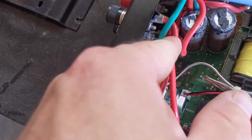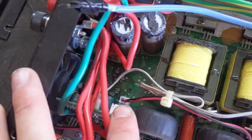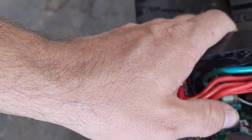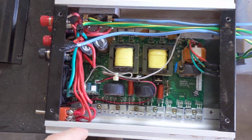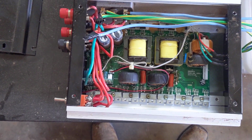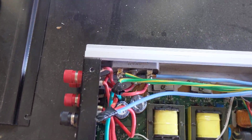And then it's hard for me. I think that this over here, this little daughter board, that's what's making it to where it can control voltage and keep up with everything else. With the other controllers, what I found, even if you run them to a rectifier and then plug them into the grid tie controller, they change voltage so quickly that those grid ties can't keep up with it.